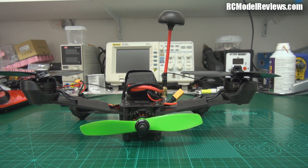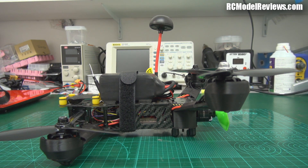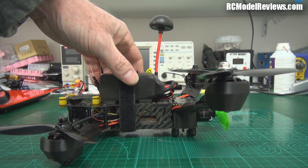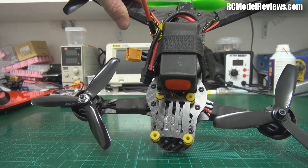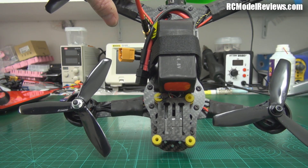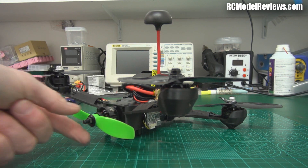I really love it when companies come out with innovative ideas. We've had a lot of ideas as to how to make quadcopters faster — tilting the motors, using round section arms, all sorts of things to reduce drag. One of the problems with a racing quad is that if you look at it straight on there's not a lot of area, but as you start putting in tilt, look at all that area presenting itself to the airstream. To go fast you've got to angle it up more, which means more drag — it's a law of diminishing returns. So how else can we make a mini quadcopter go fast except push it from the back with a thrust motor?